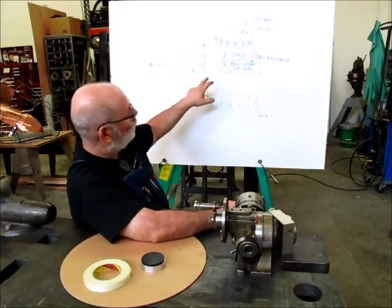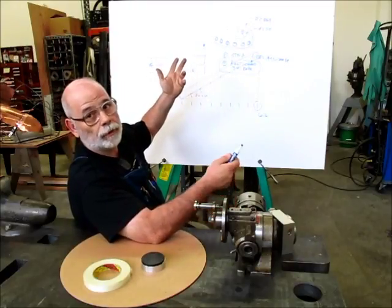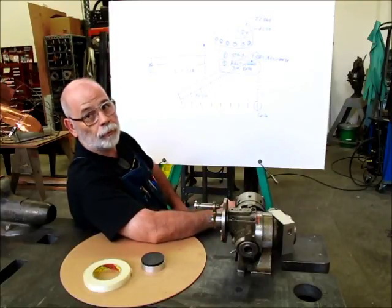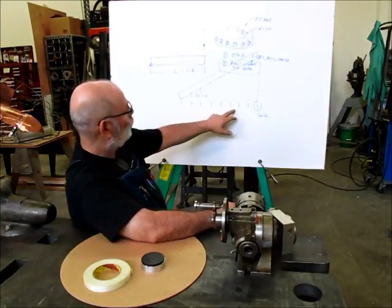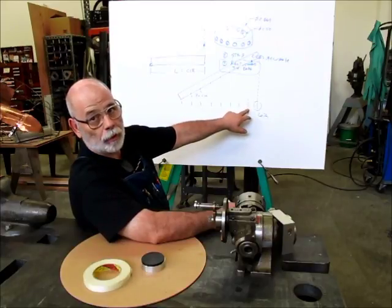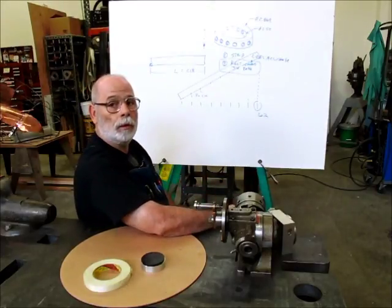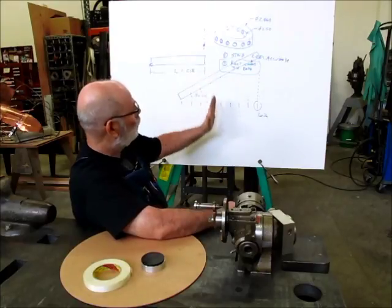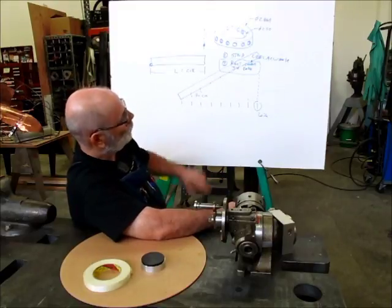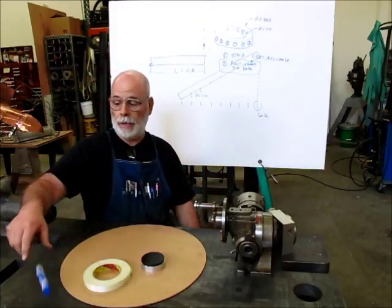So this is a graphical method of dividing a strip of some length, and we don't care what the length is. It could be any length. So we almost don't need any measuring tools here. The only thing we need measuring tools for are these equal spaces, and these are completely arbitrary. You could step these off with a pair of dividers in 20 equal increments, and it would work fine. We would just transfer those lines straight up and intersect this angle. So that's what we're going to show with the tape, and I'll show you a close-up with the video.